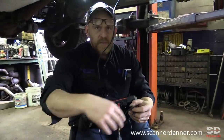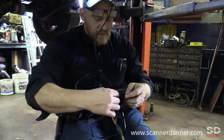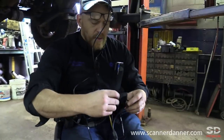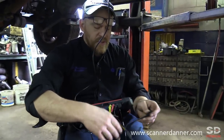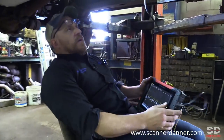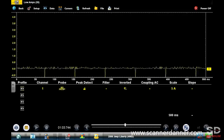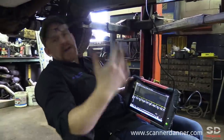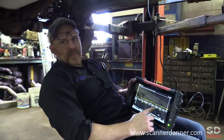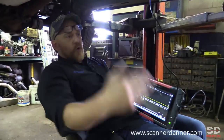Let me ask you something real quick — as you're measuring amperage with that clamp, polarity doesn't matter? Is that because it's amperage you're measuring? Polarity matters when you're doing amperage measurements because if I get my polarity wrong — watch, I'm going to invert it — see, it's upside down. So if I get the clamp backwards, it's just going to turn it upside down. So it is important, but not important — I can just take my scope and flip it.